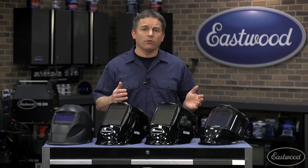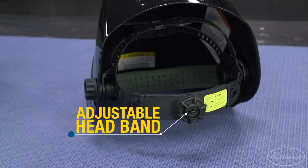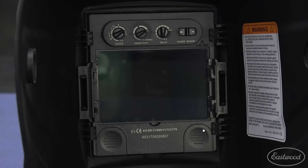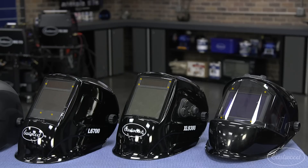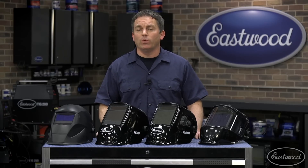Now let's take a look at these other three helmets that have a lot more features that you want or may need in a quality welding helmet. All are made of impact-resistant nylon and have an adjustable headband with replaceable sweatband, plus a five-way adjustable tilt to allow you to get the helmet at the proper angle to your head and eyes. All adjustments are easily made with a few turns of the knobs. They all have arc-charging batteries that recharge while you're welding, and four arc sensors for improved dimming when you're striking an arc, which is necessary for doing low amperage TIG welding. They also include the standard adjustments for delay, sensitivity, and shade, including grind mode to allow you to get the exact performance you need when you're welding.